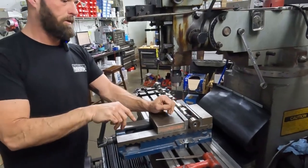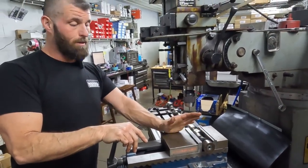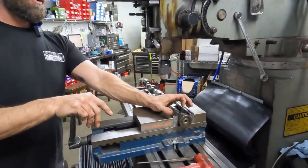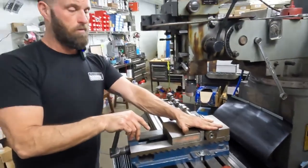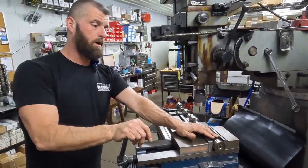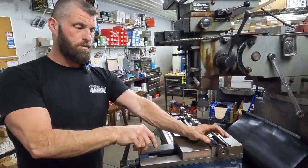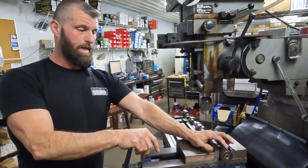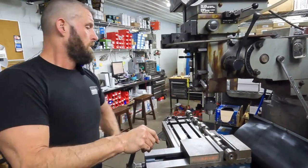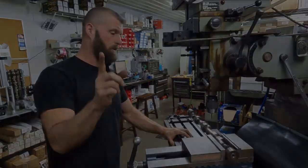So this one is repaired and then we'll just have to do the same thing to the other one. Generally speaking — not always — but generally speaking it's a pretty straightforward operation. Sometimes it'll try to gall the back journal and that's trouble, but usually they come on and off pretty fair. Just be aware that these cores can be repaired. Once it's all back together, we put it between centers and confirm that journal runout is zero or close to it. Hopefully that was helpful — like, share, subscribe, check out the website. We'll see you on the next one.